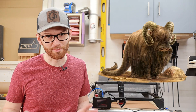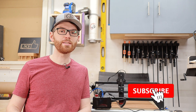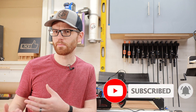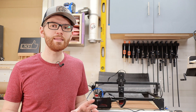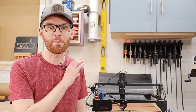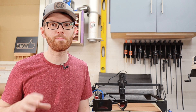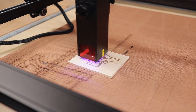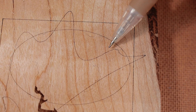Let's address the Bantha in the room. Pretty much every single listing for a diode laser on Amazon has weird typos — or possibly purposeful typos — which make these lasers appear too good to be true. For the sake of the overview, I'm going to give them the benefit of the doubt and assume they meant it can cut 1.6mm thick wood, which is totally fair. The laser is happiest moving between 1 and 100mm per second — any faster and the engrave tends to be fairly light, and we even see some jittering in the corners due to physics.